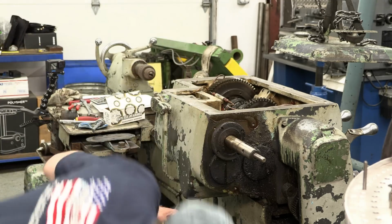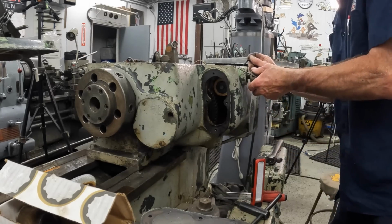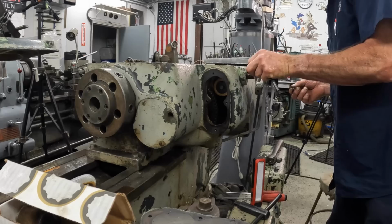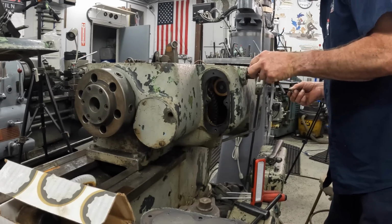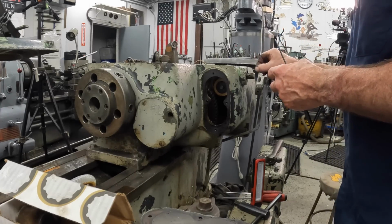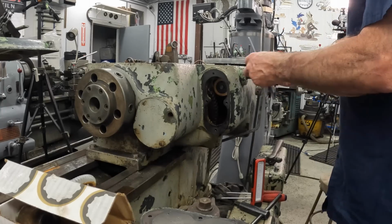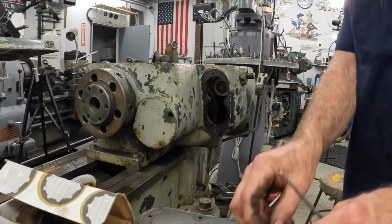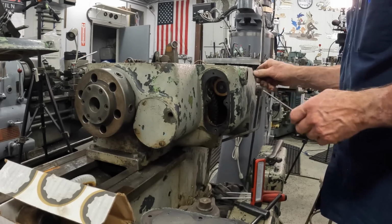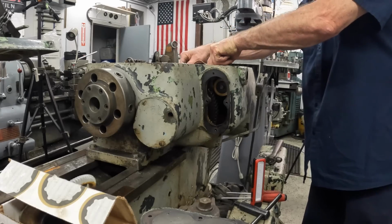Okay. Nice little taper pin. Okay, and that arm is now disconnected. Woodruff key in there. That's not a real tight Woodruff key. I kind of like to have it tight in the shaft and slip through the arm, but this also has a roll pin. Okay, that can go through that way, so we don't have to worry about pulling that other one.